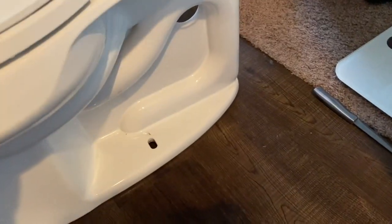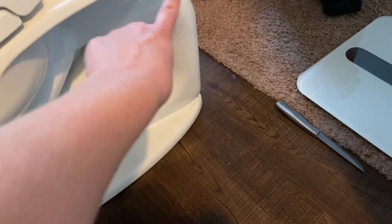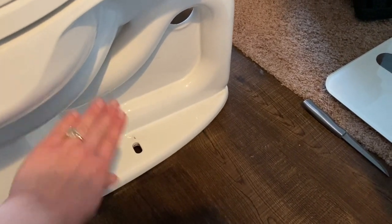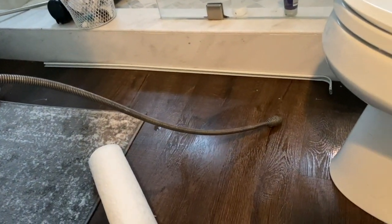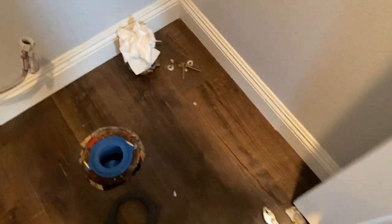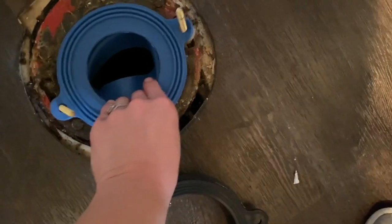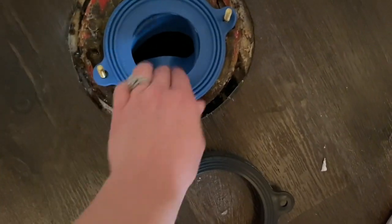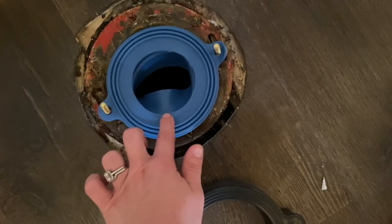So the trouble that I came into was the drain right over here. As you can see, there's a curve, and the candle was lodged right there. So what I did is I got a heavy duty toilet snake and I pretty much just snaked it from the back end. With a lot of force, I finally got the candle out. So now we're going to have to put the toilet back. I went ahead and took off the old wax seal and all its parts, and I'm trying a new seal that I saw at Home Depot — a rubber one where if you mess up, you can reseal it. It was actually pretty easy to put in.